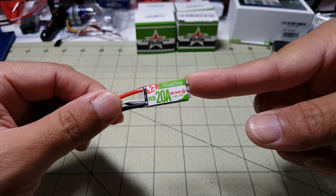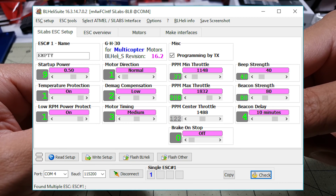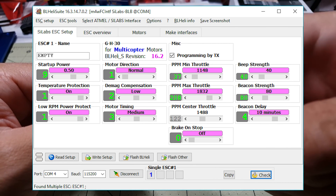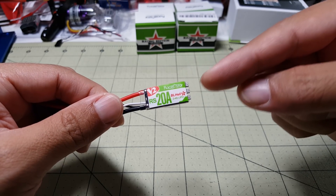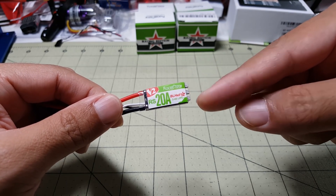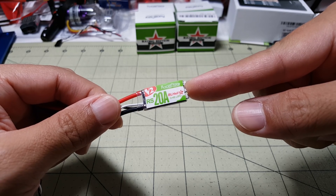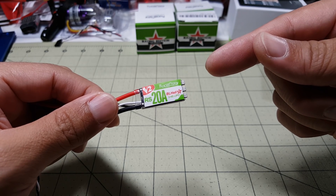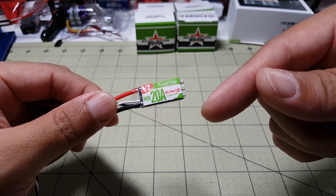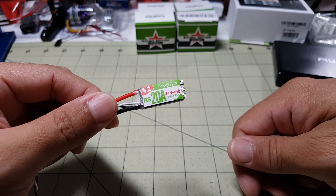I did hook this up to BLHeli Suite. It came with version 16.2 of the BLHeli_S firmware. I'll put a screenshot of the exact hex file name — something like GH30. They do have some strange names for these hex files, but it updated to 16.3 no problem. I've already calibrated it with the proper settings and motor timings. It's pretty easy to do updates and it should work through the Cleanflight pass-through as well, so you can flash these through your flight controller perfectly fine in BLHeli Suite.